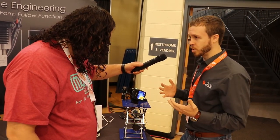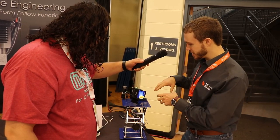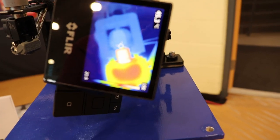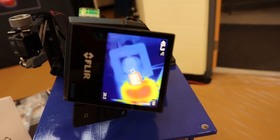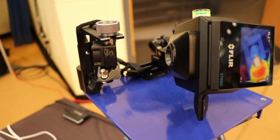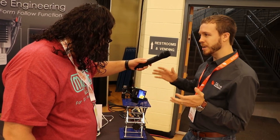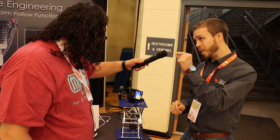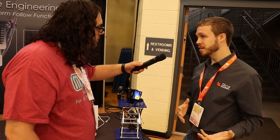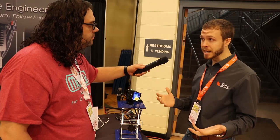This is our Magnum version, which is our high-flow version. It does about 40 cubic millimeters per second of flow rate. What you can see here is we've got the hot section pretty hot, a little over 190 degrees C, and the cold section is pretty dang cold — I can put my hand on it and leave it there for a long time. We've got about a 100 to 160 degree delta in temperature over a 1 millimeter span. That's how efficient our heat break is — it conducts 80% less heat upwards through the filament path than a standard heat break.